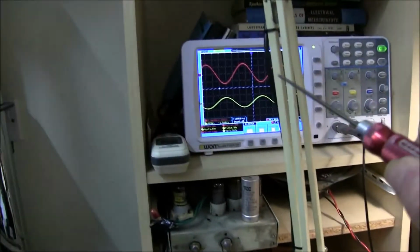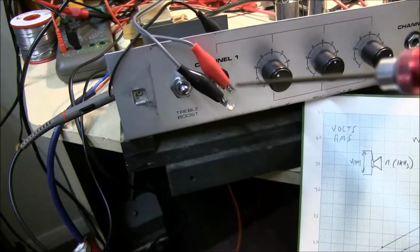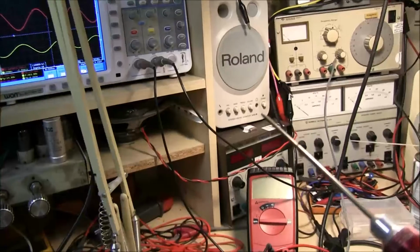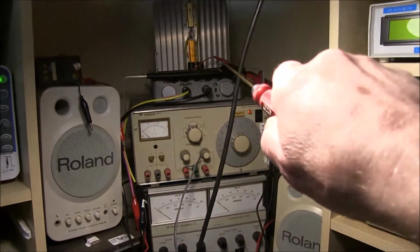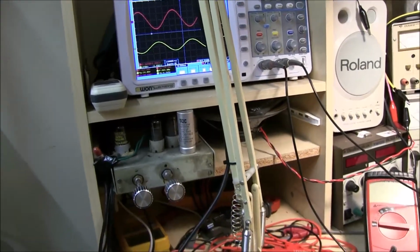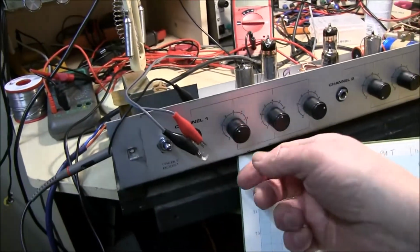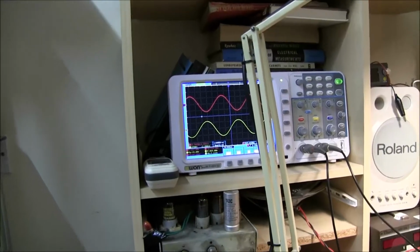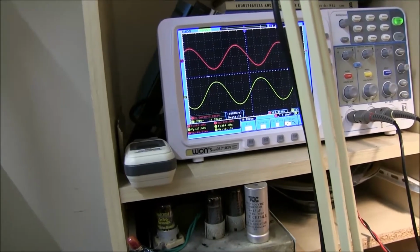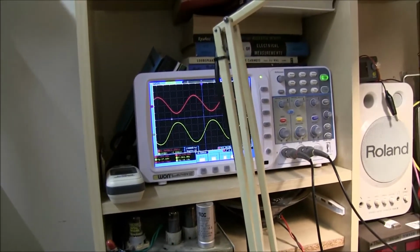I've got a scope which shows this is the input shape coming in from the signal generator, and the yellow one is actually connected to the load up there, measuring when it peaks out, starts distorting. So I've got the best of all worlds here, I can measure. So coming in here I can turn up the amplitude. Now its frequency at the moment is quite low, 363 Hertz, and you can see it distorts.